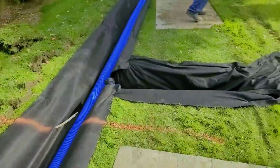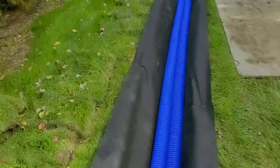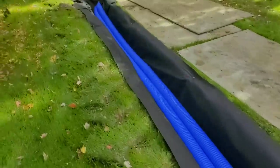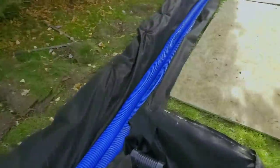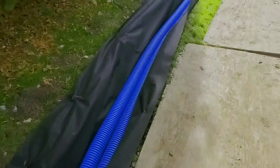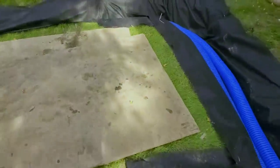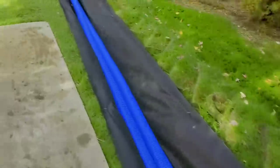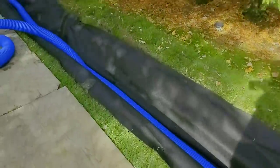We're not going to use a lot of stone because we've got a quad pack, but this is going to be a bigger reservoir and it's going to move more water — a better yard drain for the homeowner and for the installer, whether you're DIY or contractor. If you can get better flow out of the high octane than you can stone, which is the case, we'll run the quad, lock it up with some surface stone, build a better yard drain. It's less labor, less material — pipe is cheaper than stone any way you look at it.